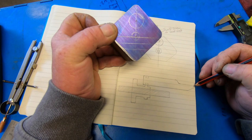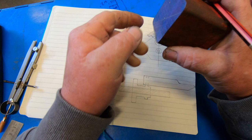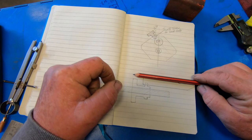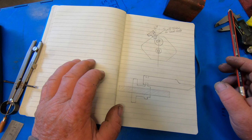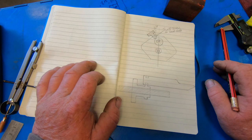This I've tried to draw the 3/8 side of it. So it'll be a piece of thread come out of this end of it with a nut. The pin will have a recess cut into it that when you screw the nut, it'll pull the pin back and forwards. There's plenty of these sorts. I'll pinch this idea off YouTube anyway. A few different designs, and I think a lot of the tailstocks you get for indexing heads are the same. So this is just a wild version of that.